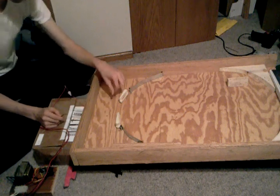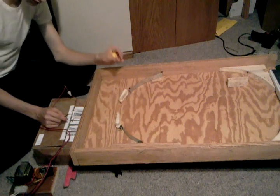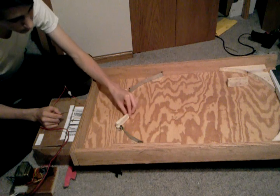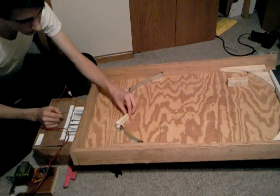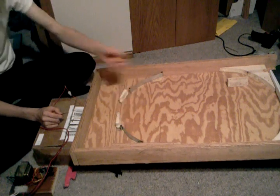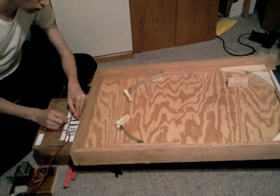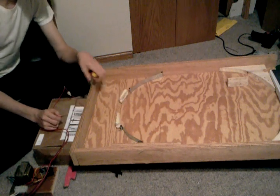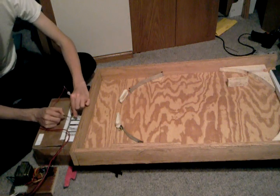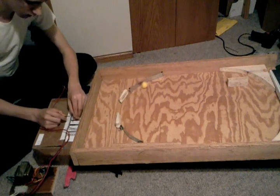This is wired up with switches underneath which allow us to change the amount of the coil used, so that it holds less amperage when the flipper is up, letting it hold without the full amount of current — because you don't need that much. So it's hooked up with those switches underneath so we can hold it and nothing gets hot, nothing gets hurt. As you can see, there is a little bit of spark when that happens just because a lot of current is going through.